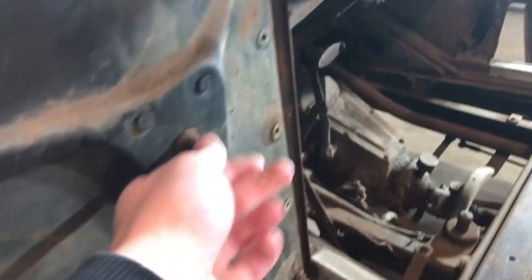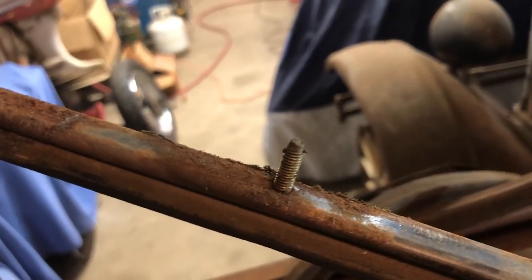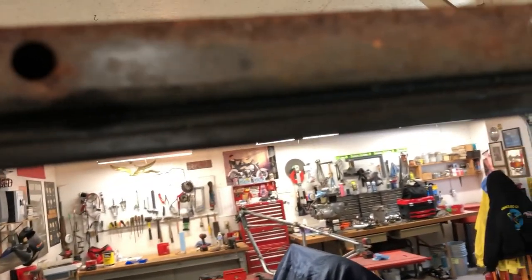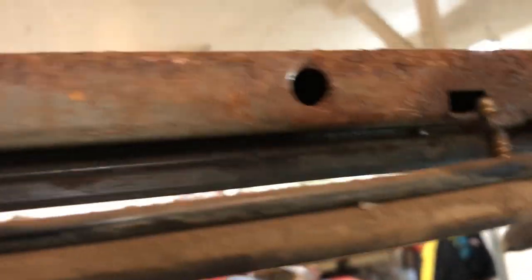I'll show you the other side — that little roller. This side is the same thing. But up here to get the top window sill out, you have to take this piece out. It's held in with three little brass screws in these little holes. You have to unscrew it — there are nuts in there. They're supposed to stay in there but not all of them did. You just unscrew that.